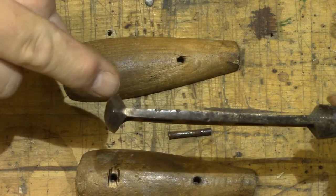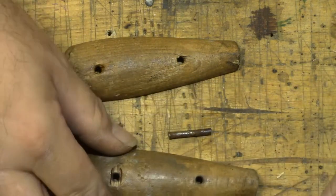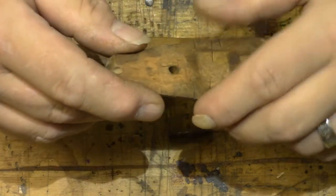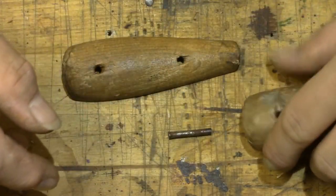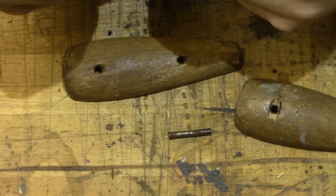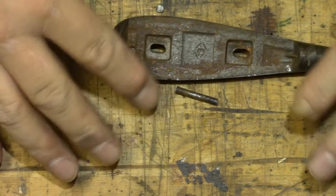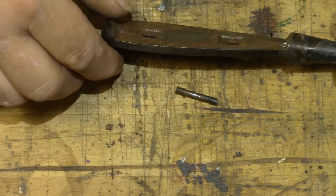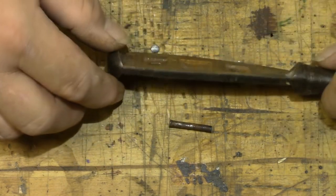These are angled out on both ends, so I'll need to measure that angle with my doohickey here. That's coming in right at 57 degrees, so I'll take a few measurements, get the blanks cut, and make sure that they'll fit here the way I want them to.